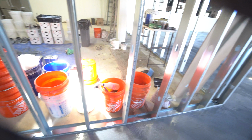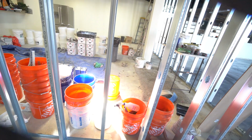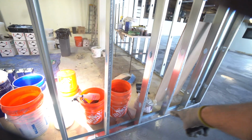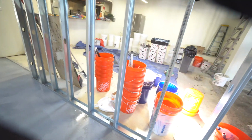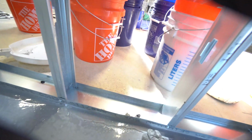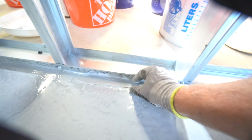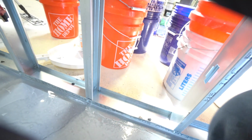I had to rebuild all of this against this, I guess, new wall, or I'm assuming it's probably new. But down in the base right there against that metal, it was just a big crevasse, and I had to rebuild what you can see here. I had to rebuild all of this because it was just a big crack all the way along the whole thing, and our coatings won't cover. They'll just fall down in there and it'll just be ugly. So that had to be done.